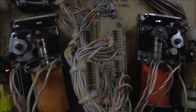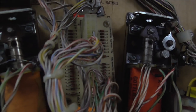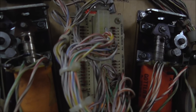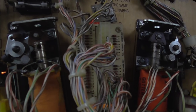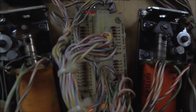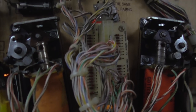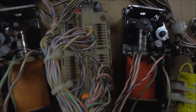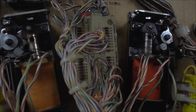I'm going to turn the game off. If you're messing with switches and matrixes and stuff, you don't really want to unplug connectors while the game is on. You saw me unplug a switch, but I'm just disconnecting one switch. You wouldn't want to unplug this entire diode board — that might cause issues. So I'm going to turn the game off, unplug that board, put it on the bench and see if we can figure anything out. Maybe we can test those diodes and see if we can find any bad ones.